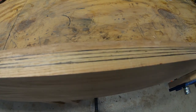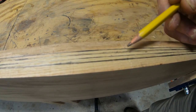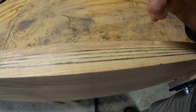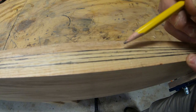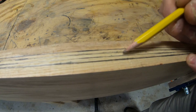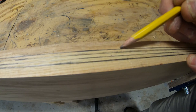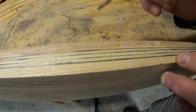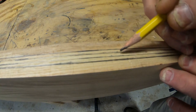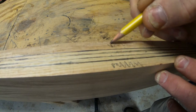Taking a closer look at the lines I've marked — these two outside lines are the total blade thickness. It's going to taper down to the edges, and these are the 3/32nd blade edge lines here. At the center line of the spine it's going to taper down to the blade edge, so all of this material will be removed.